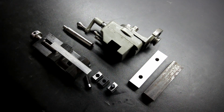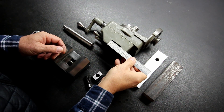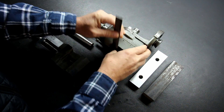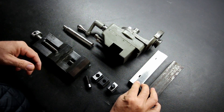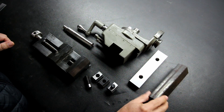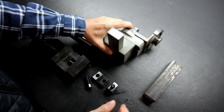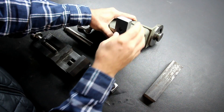The dimensions on this are one and a half by three, although it's just slightly under one and a half, and the piece of stock that I made is six inches long. The stock I started with is one and a half by one and an eighth, and it wound up being just slightly under one and a half by thirteen-sixteenths. I left it six inches long so I could offset it in the vise if need be, but I want to use it on center for the most part.